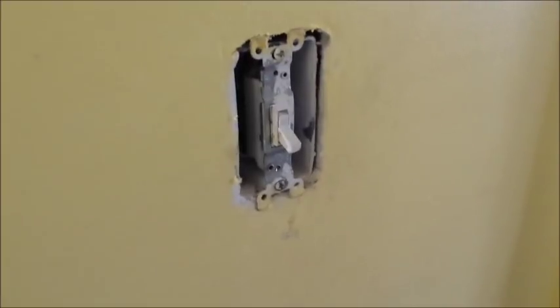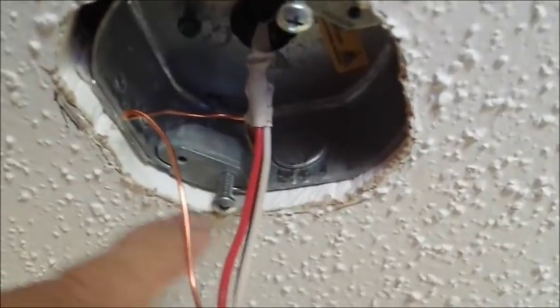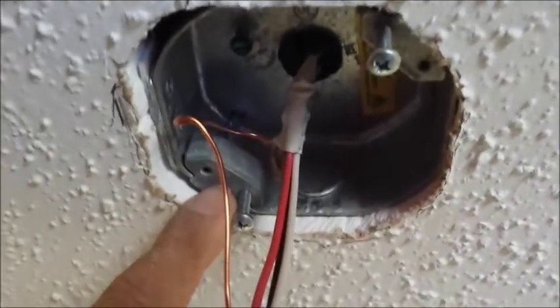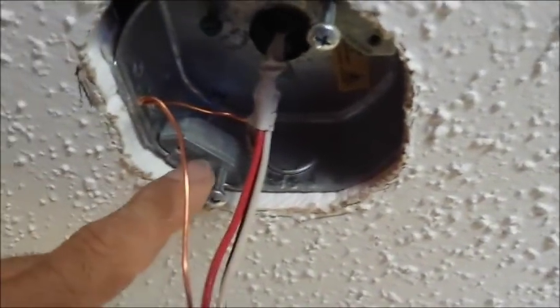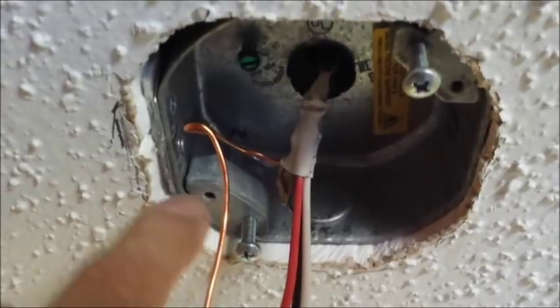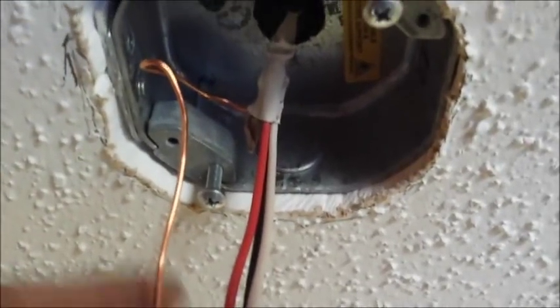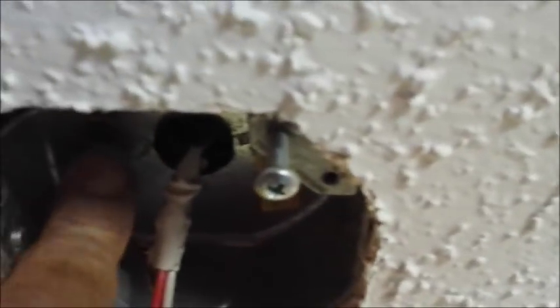I've got that all closed up and put back. All we need is a cover plate on there. Now let's go check out this end up here. We've got our wiring sticking down through the box just how we sent it through — there's our restraint clip. At the point of time when this video is being made, all fan boxes need to be metal to be code approved. You know, at some point they may come out with a plastic box that's strong enough, but at this point we use metal boxes. Anytime you use a metal box, you have to ground the box itself and the fixture both. So what we're going to do is use this ground screw and we're going to wrap our ground wire around there.